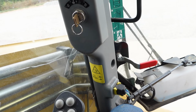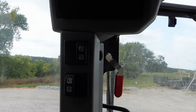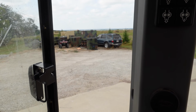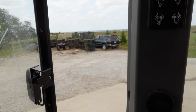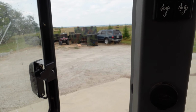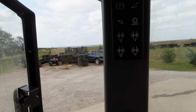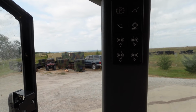The other part of it is there's like a 2-stage overheating system. When it starts to get warm, instead of just shutting off your high flow, it stays on, but it derates the flow. When it derates it, the disc mulcher quits spinning as quickly, and if that mulcher is not spinning at full speed, it doesn't have enough momentum and inertia to suck branches or trees in and mulch them and spit them out. It'll suck them in, it'll lose momentum, and the tree will get lodged in the mulcher. So it'd be better to let the machine continue running at full speed until the full overheat temperature, and then just shut the high flow off completely until you cool back down below whatever temperature.